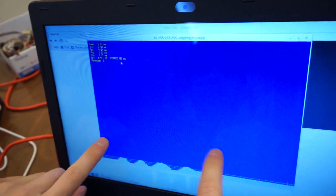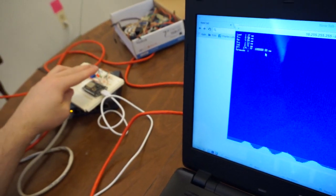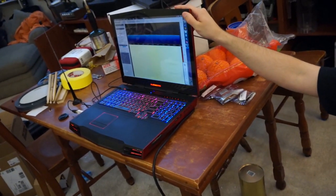The way this is working is because this thing right here is sending out pings to the ESP8266. There's a whole lot of extra noise on the line that's creating a lot of disruption that is being picked up in the AM band by the RTL SDR sitting over here. So this is kind of an interesting way we can almost hear the Ethernet packets.